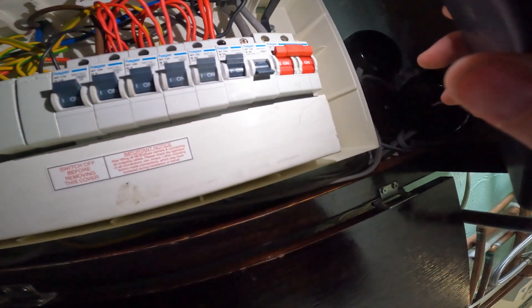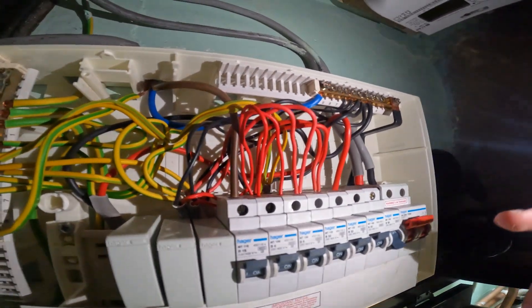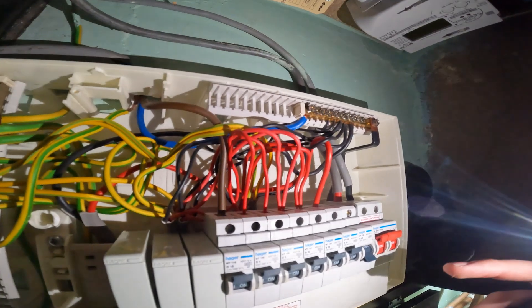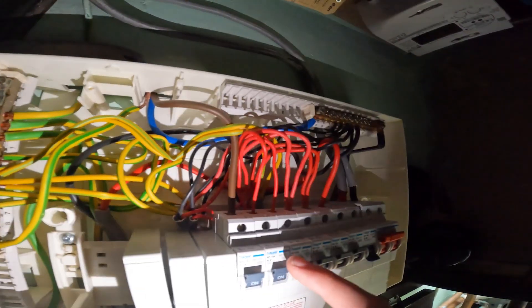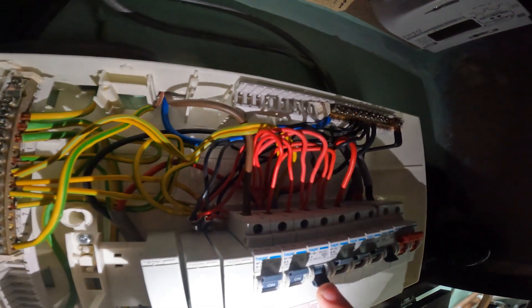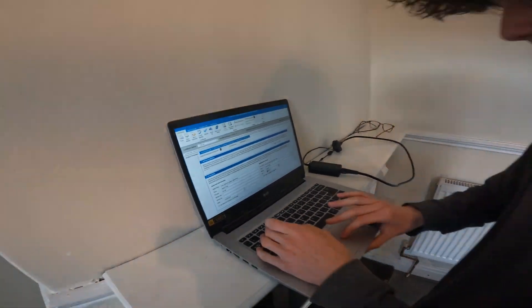They're supposed to be moving in today. They might have to do some works while they're in. We'll have to swap the sockets - any socket outlets will have to be RCD protected, and the circuits in the bathroom. I'm missing that one lighting circuit which seems to do everything. Right then, let's get testing - that's your visual over. Herbie's just having a go filling out the cert. There's quite a lot of paperwork to do with EICRs, plus it gives me a break from leaning on my side and breaking my neck.